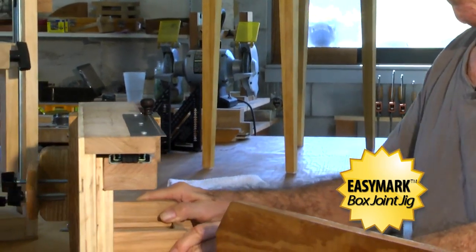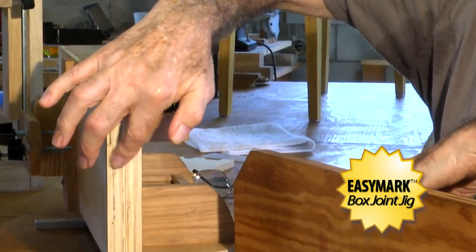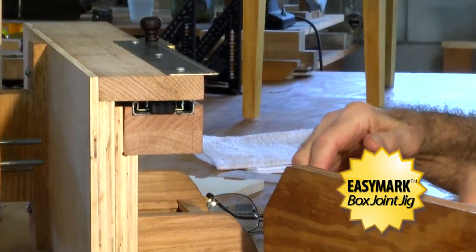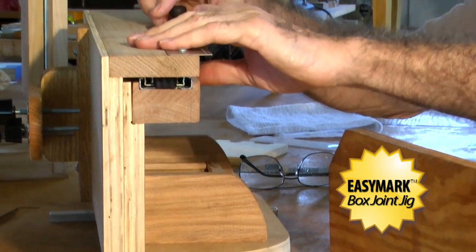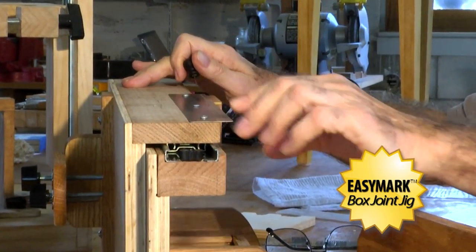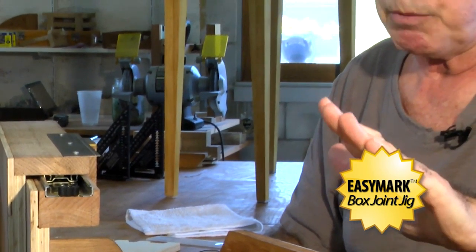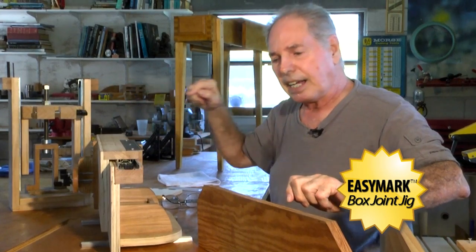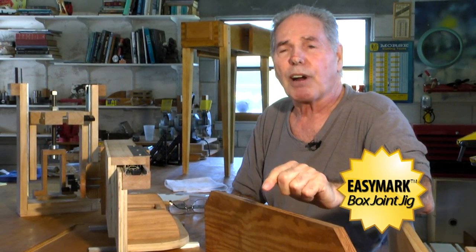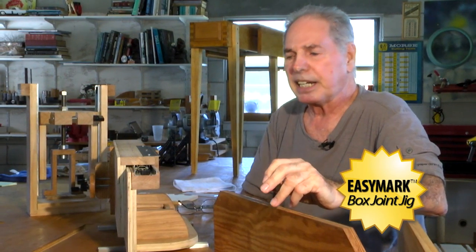Let me show you how I made this jig. This is the jig itself, and you'll notice that it's two panels — one panel over the other panel. One panel is fixed to the base and doesn't move. The other panel slides and is movable, and the reason it slides is because it has a ball bearing drawer slide. That ball bearing drawer slide works very well. I've used it on my router lifts before with excellent results. In fact, I have one hooked on my router table for the past year and a half with excellent results. So I decided to use it on my EZMark jig, and it works equally as well.